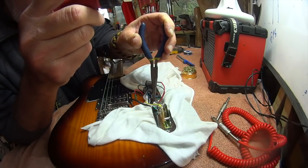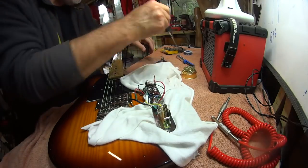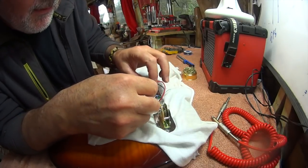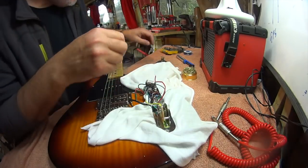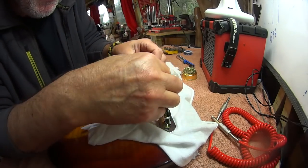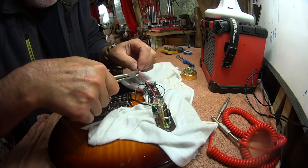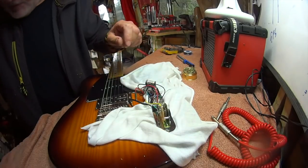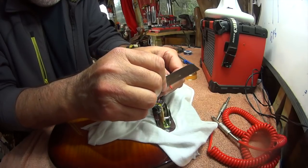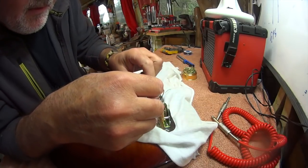Okay. So it's the red and the bare now going to the top. And we've got to get the red and the black here back onto this first post here, and that is going to be quite tricky because this thing, first of all, now it's too long, so we can adjust this somewhat, and we can strip it and give it a little thinner aspect so that it stands a chance of getting through that little arch at the same time. In fact, we can even thin it out a little bit.